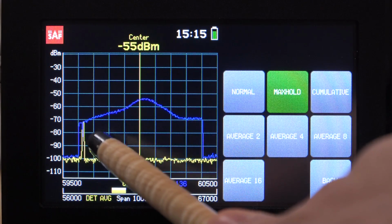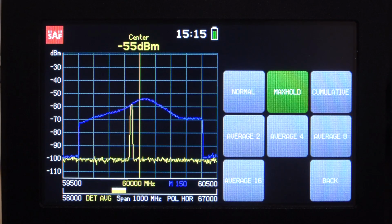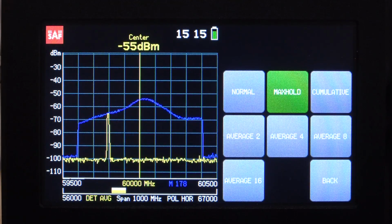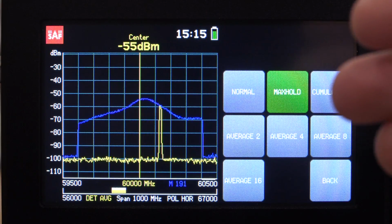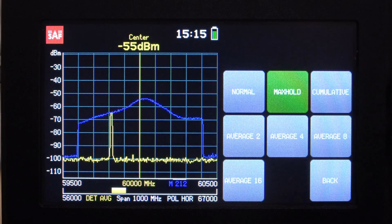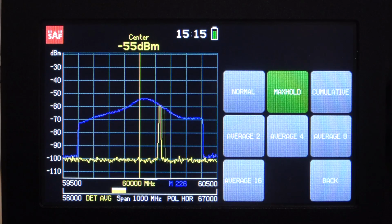There you go. Now that we have had it built for a while, you can see a very nice plot of exactly where the signal spends most of its time, which is what I was trying to measure initially. And you can see we have a very interesting response. This transmitter is clearly tuned at 60 gigahertz. It has the highest power at 60 gigahertz. The distance between this antenna and the transmitter is not very high, and therefore these drops that you see here are simply the transfer function of our transmitter itself and not from over-the-air measurement or from anything else.